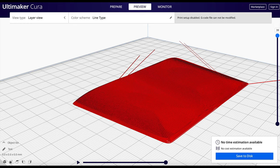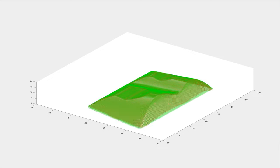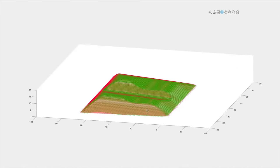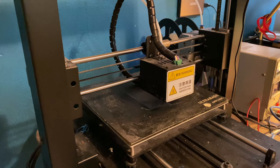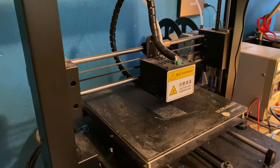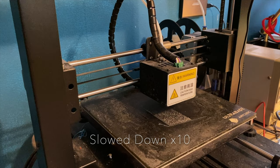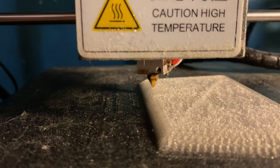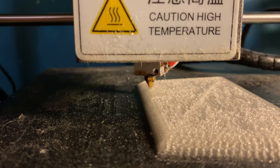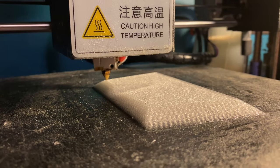Getting all paths into G-code was its own challenge that still needs perfecting. Initial G-code testing revealed a single misplaced point in the planar infill causing the extruder to travel to the far end of the part on every line. After fixing that, there was a weird piecewise stuttering behavior where the printer paused at regular time intervals — the source of which I still don't know. Path planning for the planar slicer also wasn't great, leaving plastic bits across the interior as it ran to complete wall infill.